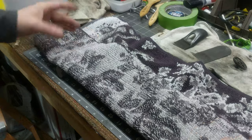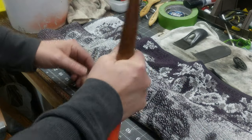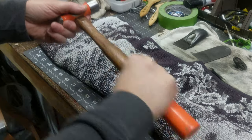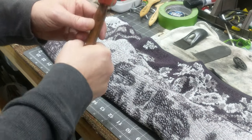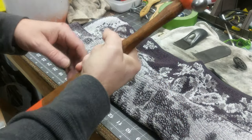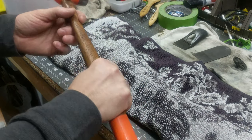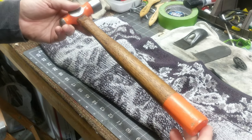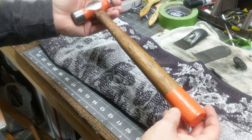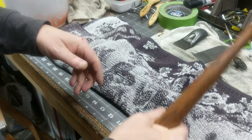Before we get to that, here's a short hammer — but this one has a relatively long handle. If you choke up on it, it gives you some options. But in some cases you do need just a short handle. If I'm doing really delicate work I'll choke up, but then you've got all this handle that can interfere and get in the way. A short handle for light work is a good thing. Hammer handles are customizable — the length that suits you may not suit me. They're very personal things, but in general the longer your handle the more leverage you have.